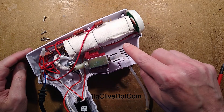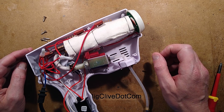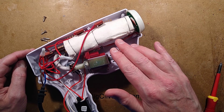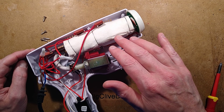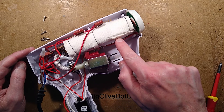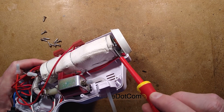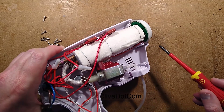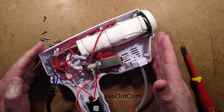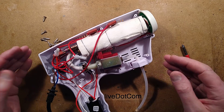That means this is going to be red hot. This material here — I'm hoping that's ceramic fibre. It's unfortunate that China still uses asbestos quite widely, and there have been reports of products from China with asbestos in them, so there's no guarantee. If it is asbestos, it will probably be chrysotile asbestos, which is not as harmful as the others, but it's not ideal. I'll proceed with caution. That's got screws holding that shut — I'm going to have to go deeper into this. I'm going to pause momentarily, add that resistor, and try it out to see if we can actually control the speed.